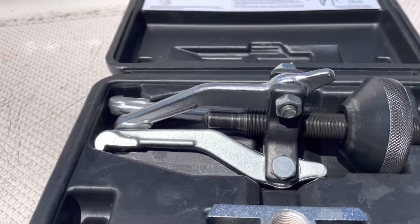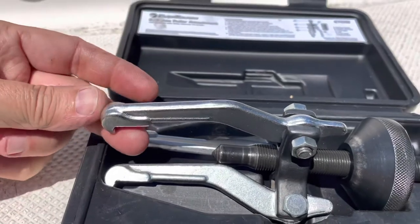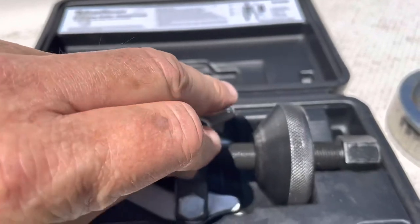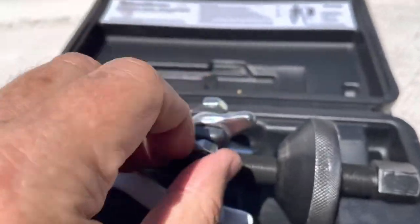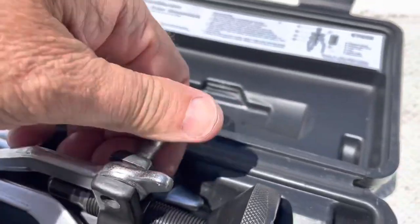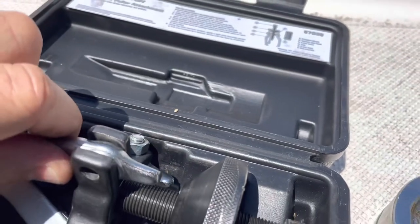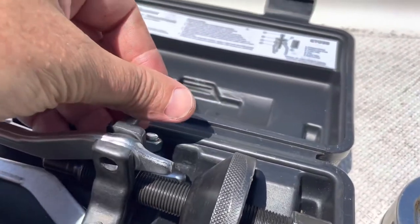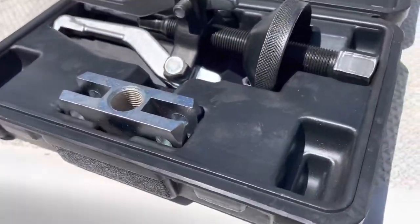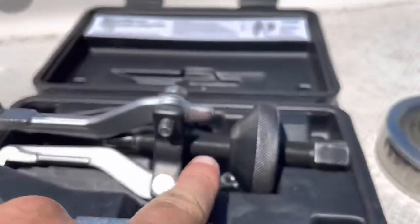This device takes a special trick to make it work with a big gimbal bearing. The first thing you have to do is make sure all the teeth on these little arms here are pointing outward. This one has to be taken apart and reversed — it looks like they put it this way so it fit inside the case. You push it out, unscrew it, take it off, flip it around so the tooth is pointing outwards, and put it back together.